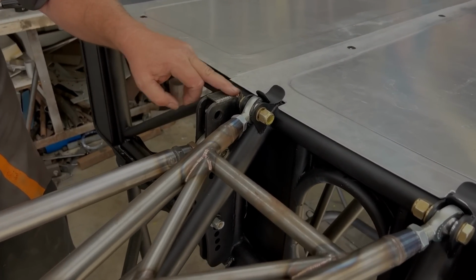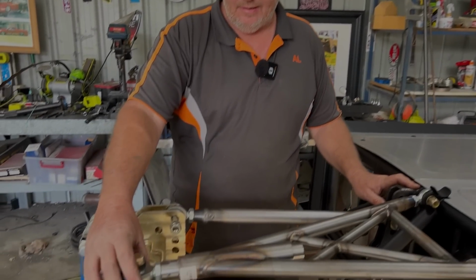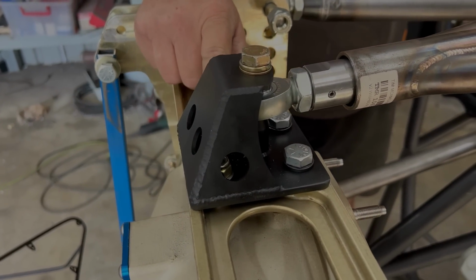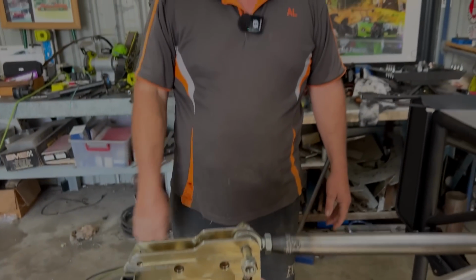We whacked in a couple of little gussets on the bottom of the forelink. That's the place where they can sometimes get a little crack. We've got that wishbone bracket all painted out, bolted down. We've got 1/2-inch bolts going into the diff and also some 7/16 ARPs locking that all in there. So let's flip it over and get started on that ARB.